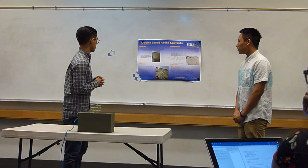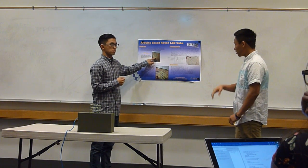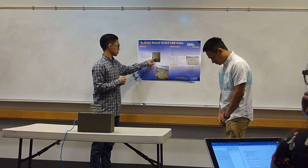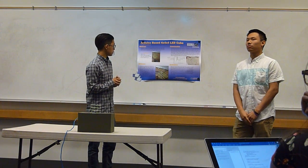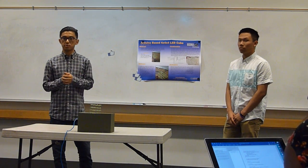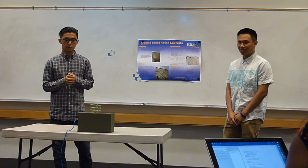And then for the 16 anode legs, we had a 370 ohm resistor per anode leg, and we connected that in series through our copper circuit board, and ultimately we were left with 16 anode wires and 4 cathode wires. And luckily we had enough ports on our Arduino. We needed a total of 20 ports, and that required 20 jumper wires.